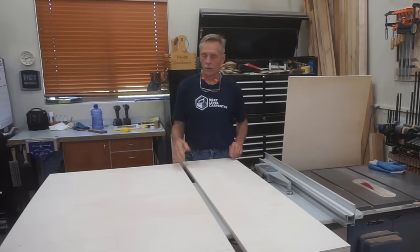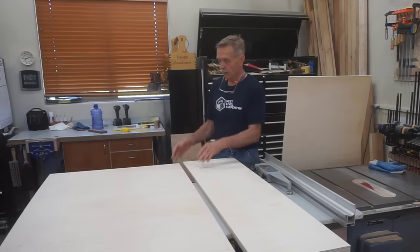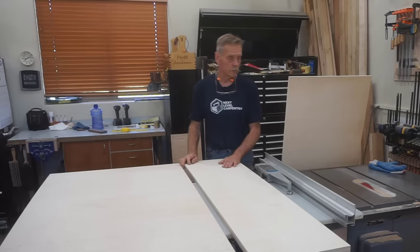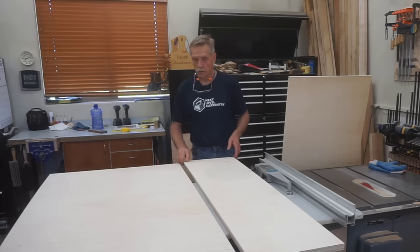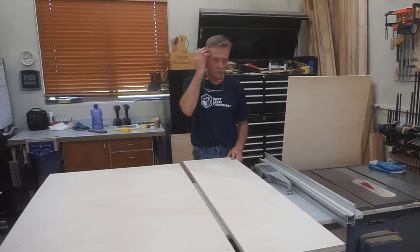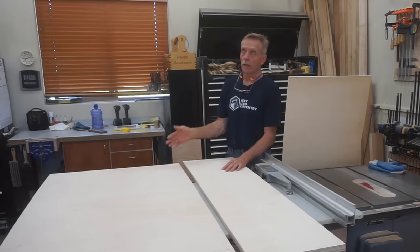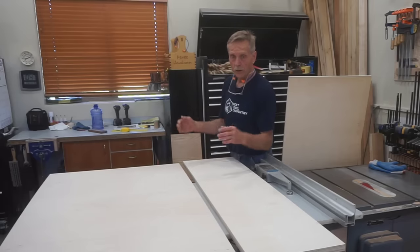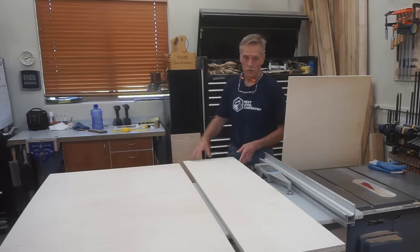And the size of the sheet and the number of parts I get out of these is a little bit forgiving, so I don't have to get my rips down so tight to the saw kerf at the risk of needing a whole other sheet of material. I always like it when I've got a little bit of a cushion there, which I do. So to do this, again, I want to break the bigger sheet down to a more manageable size. And so I'll lay out the two widest drawers, the 9.5s and the 7.5s. I'll make a rip, square everything up, and then go to cut the narrower pieces. You'll see the process, and hopefully it makes more sense.